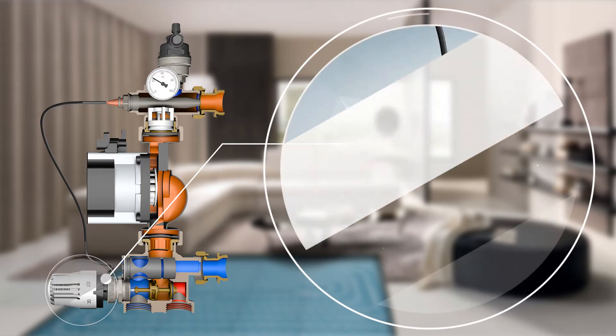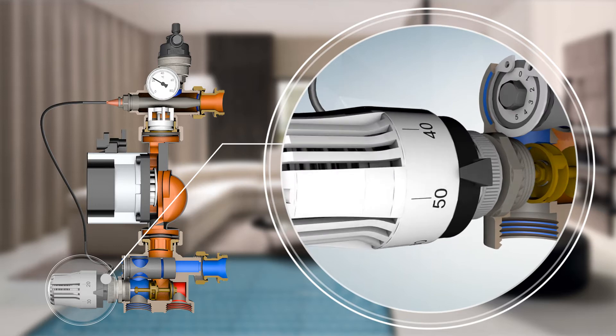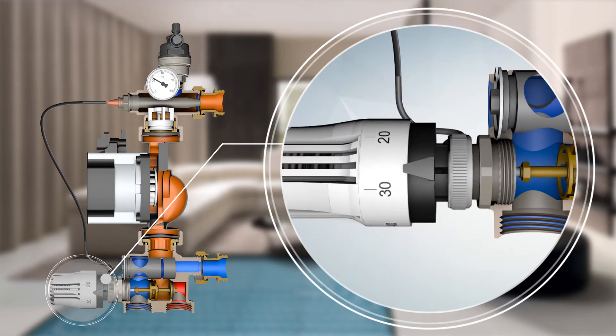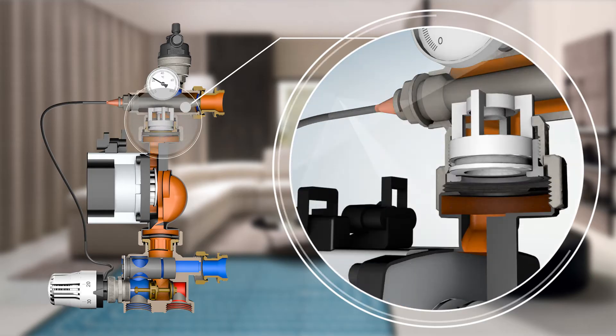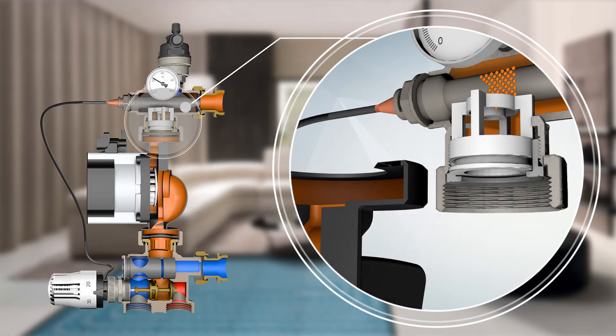The thermostatic actuator with remote sensor measures the actual temperature of the water supplied to the floor system, irrespective of primary flow temperature fluctuations, in the temperature range from 20 to 65 degrees Celsius. The high efficiency pump's check valve, positioned immediately downstream of the circulator, makes filling the system more simple. With the pre-installed drain fill valves located at the end of the manifolds, the same valve also reduces the escape of water should replacement of the pump be required in the future.